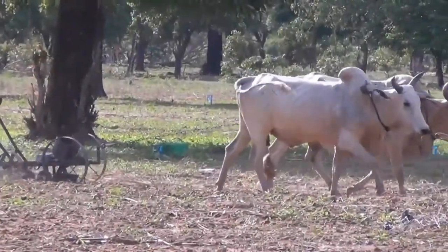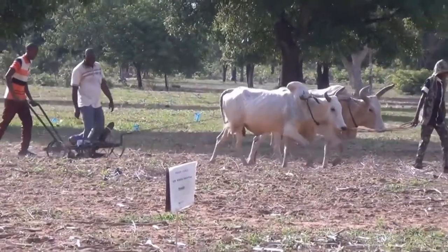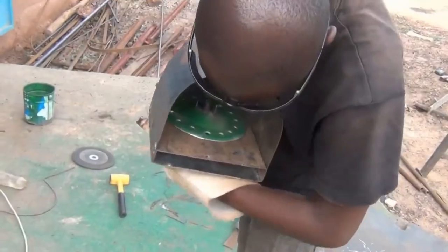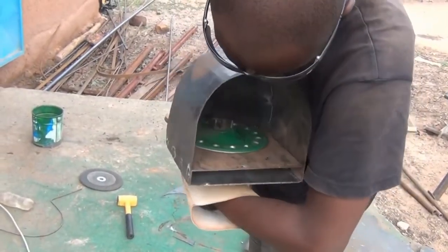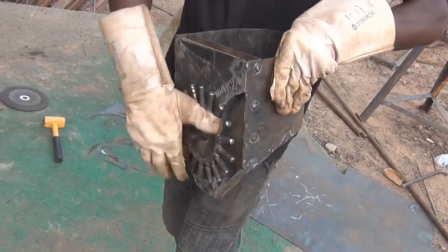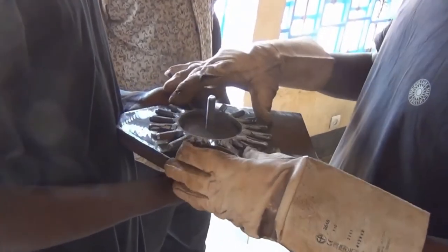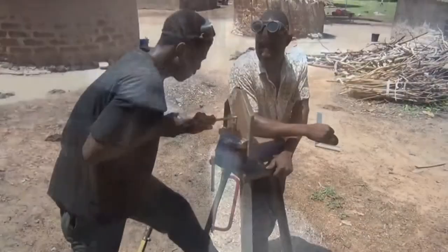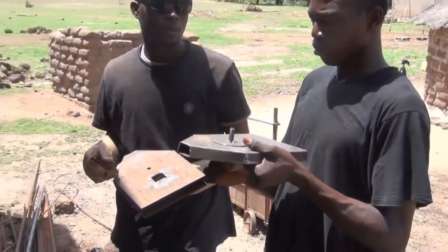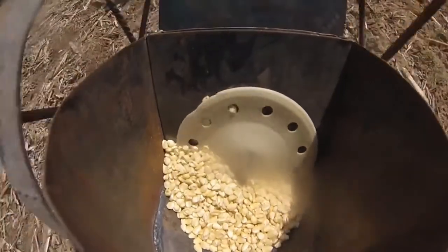Animal-drawn planters introduced in West Africa decades ago were widely rejected by farmers because of their high cost and poor performance. The success of the inline subsoiler enabled several planter innovations to improve performance in conditions of low soil disturbance and surface residue. We introduced a simple seed plate drive mechanism that the local blacksmiths can build with simple tools. We improved the seed plates and seed delivery for corn, sorghum, millet, and cowpea.